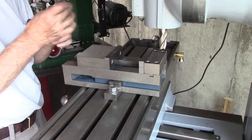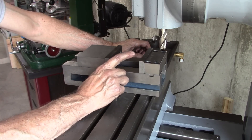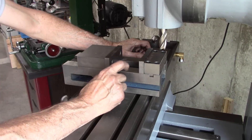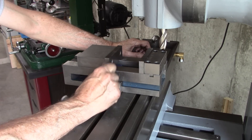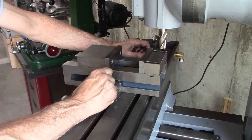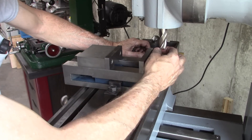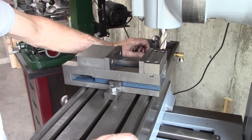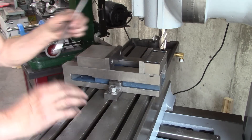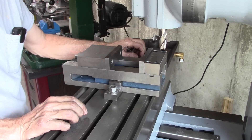Something I discovered — I was using a carbide end mill and I broke it, and that was my fault. I didn't lock the knee down, and I think it allowed it to move a little bit. I switched to a high-speed steel end mill and the high-speed steel cut way better, and it's a bigger end mill. I may go to flood coolant and high-speed steel. That was fairly impressive — the difference between the carbide and the high-speed steel and the way it cut. I knew high-speed steel was sharper, but the advantages of carbide are significant. But it really cut nice.